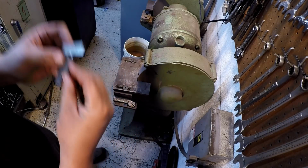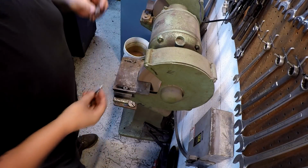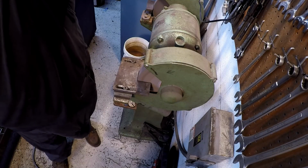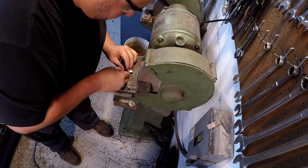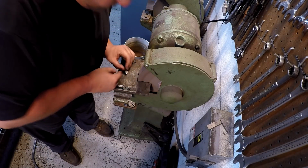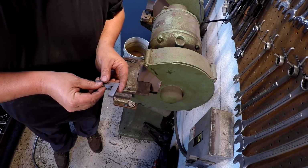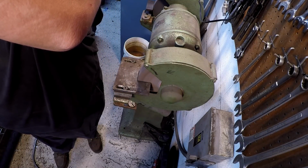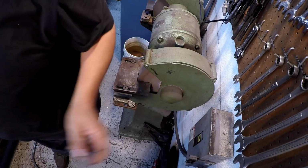Now I'm going to be pointing it up here in the light, and I've got it pretty well square just like that. I've got that clip light behind you here. All it takes is a touch, and then just check it like that in the light to see if your cutting edge is square with the side of the tool. Almost perfect right there.